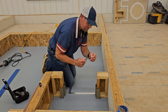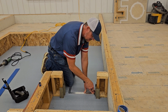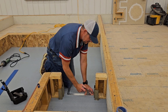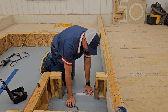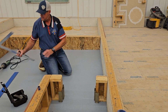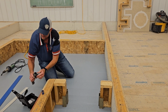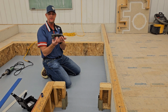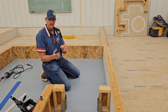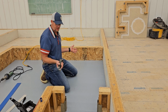And this groover being two-sided, you make your first pass, and to finish, you have to use the top of the groover to get the rest out. Now, this is the one method you can use: a hand groover, or you can use a turbo groover. These are designed to stay in your seam and groove at a faster pace.